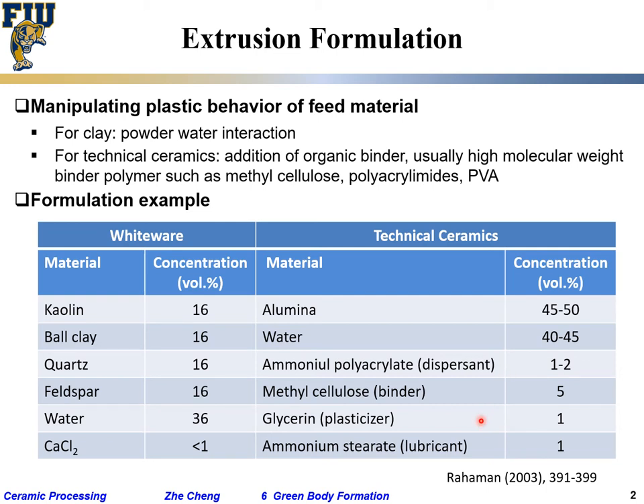People add different types of organics at relatively lower concentrations: the majority being binder, with a little dispersant, some plasticizer, and some lubricant. For a slurry or paste, you do not want too much dispersant. You also do not want too high a binder content, because the binder remains after the water leaves, and too much binder creates too high porosity after you burn off the organics, which is detrimental.